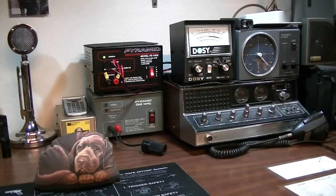So you have mobiles, you have bases, tune them up, export radios. In my previous video I was keying 3 watts and swinging to 8, keying 3 and swinging to 12. With export radios, a technician can tune them up and you might be able to dead key 2 watts and swing to 25 or 30. They have bigger finals — finals being your final transmit stage, what actually sends your signal out through your antenna. Some have dual finals; some of the new MOSFET radios have four finals and they really have the capability to push out some wattage.